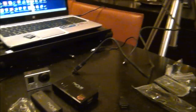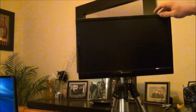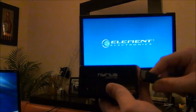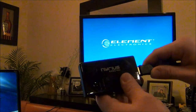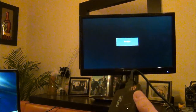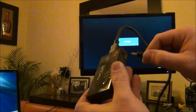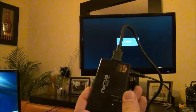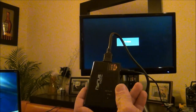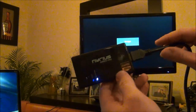We're simply going to turn this on and plug the HDMI cable into the side of the receiver, then give it power. In this case I have the adapter plugged into the wall, so we're adding five volts to it. This will be part of your ground station — you just give it five volts from a BEC, and this will run on a regular battery no problem.